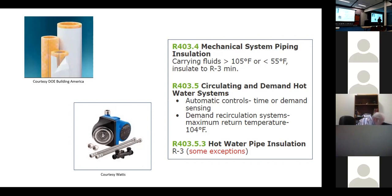Now, some companies have recognized this, and I'm involved in litigation on one of these cases right now. But some companies have recognized it, and they build into their air handlers, for this very specific application, that every day or every 8 hours or something, the pump turns on. It already has a recirc on it, it just moves that water. It turns on and runs the pump for a short period of time. So it just exchanges the water. And yes, it puts some hot water in, and then the air conditioner has to remove just a little bit of heat, but at least it refreshes the water a couple times a day, so we don't grow stuff in it.